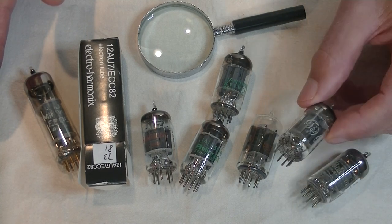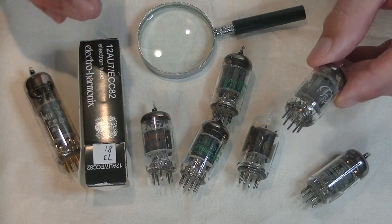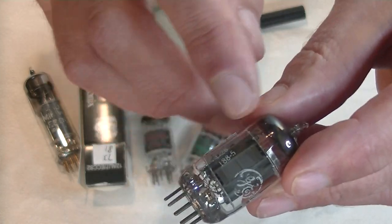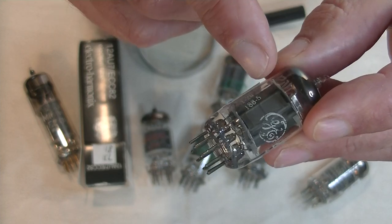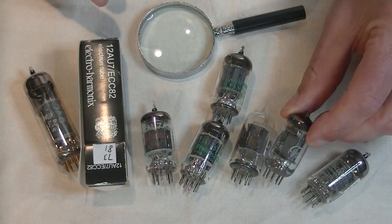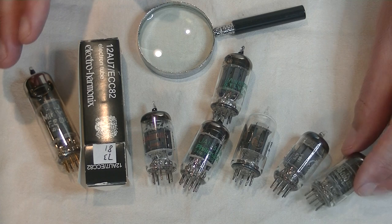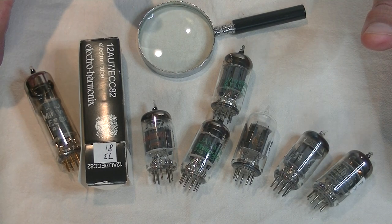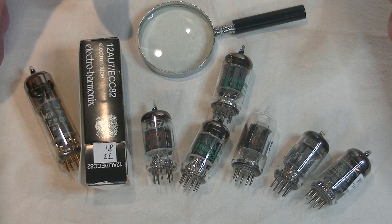Next is another GE, my number 117. It's a grey flat plate. Let's get it up here so you can see the difference — just a flat plate. I would identify this by the number of ribs: it's got one, two, three ribs. It has nice space, a rich full mid-range, and a nice detailed high-end with medium microphonics. Another nice affordable GE 12AU7.